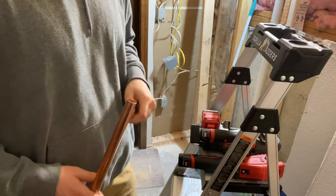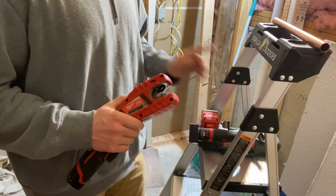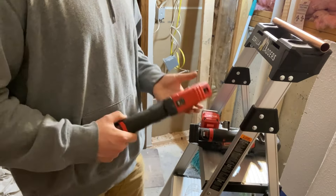In terms of what you should buy: if you're a pro plumber you should probably have both. If you're a DIYer or homeowner, the bandsaw is going to be a lot more universal of a tool — also a much more expensive tool — but I think it's probably the better buy; it's way less niche. However, the tubing cutter is going to be a lot less prone to those squareness errors, and the ergonomics and ability to get into tight places are things I do appreciate about it.